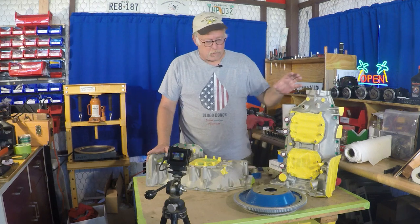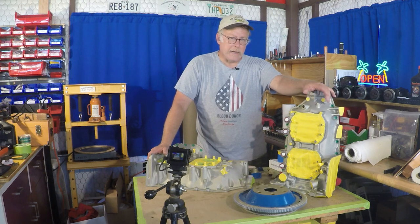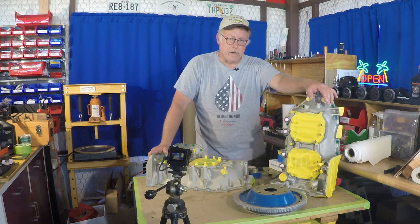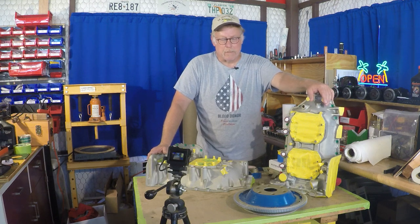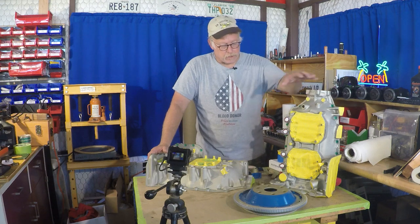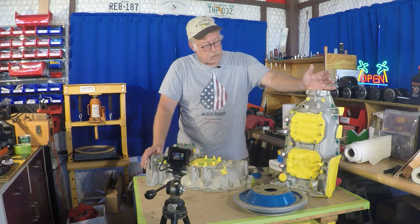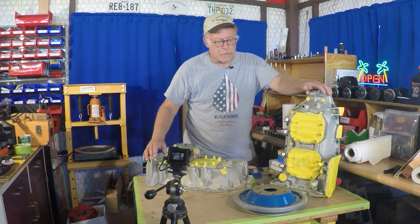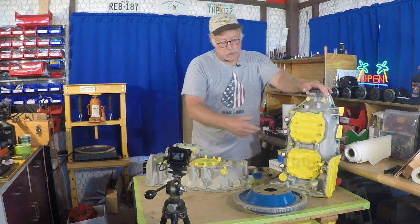These cases have not been painted. Why? Because we had not measured them yet. We don't want to paint anything until we confirm all the dimensions coming back from the machine shop. I don't want to find out I've got a dimension wrong, something needs a grind, it goes back to the machine shop and ends up messing up our paint job. This particular case set we've just finished dimensioning and everything's looking good. I prefer to make sure the ends of the studs are all painted, so I mask them up that way.